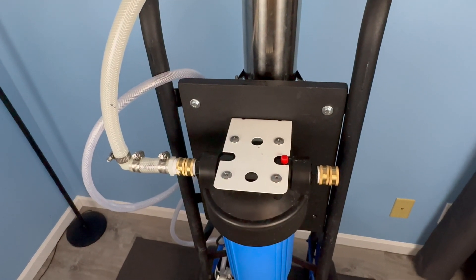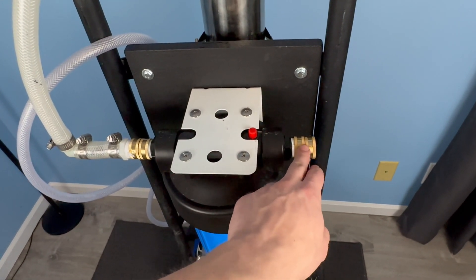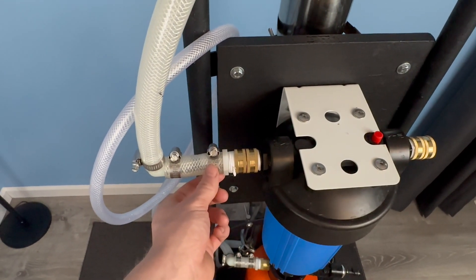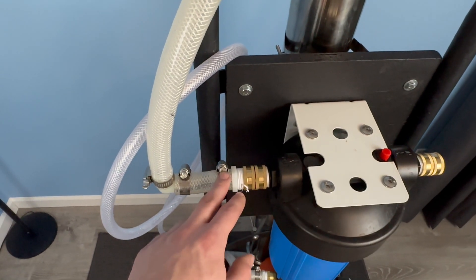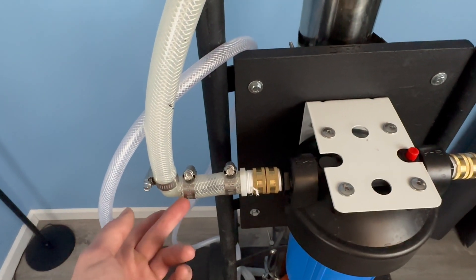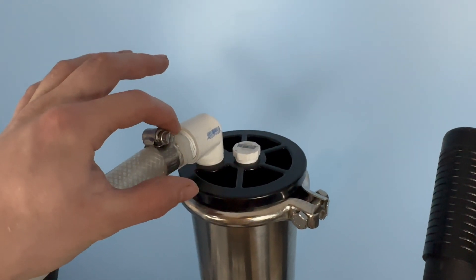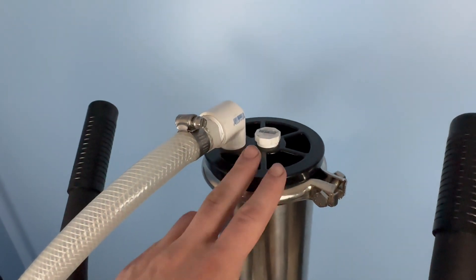For the carbon filter plumbing on the cart: the inlet connects a garden hose via a female-to-female coupling into our 1-inch to 3/4-inch adapter. On the outlet side, the same adapter leads into the female-to-female fitting where our 3/4-inch poly braid starts — using a 3/4 GHT to 3/4-inch barb fitting with a hose clamp, then a barb-to-barb 90-degree fitting with two more hose clamps, and up to the inlet cap of our RO membrane housing.